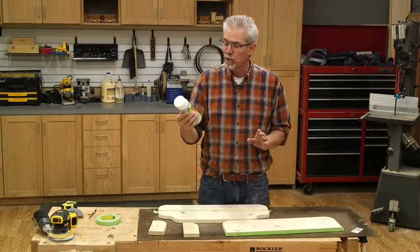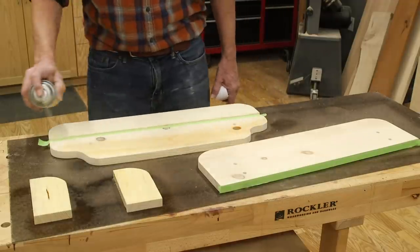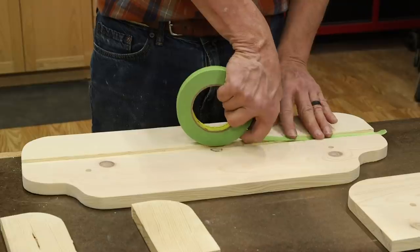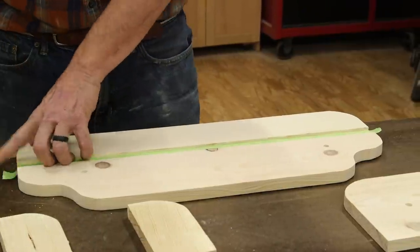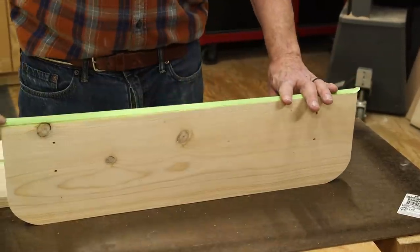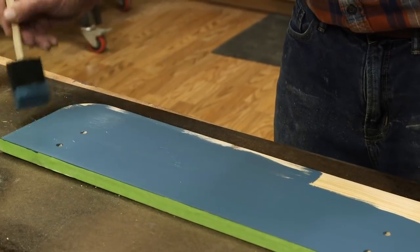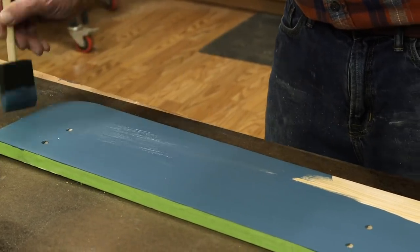Now take a few minutes to apply a few coats of spray shellac. This will serve as an actual clear finish for the back and the shelf supports. Keep the shellac out of the groove and off the back of the shelf where you'll be gluing it together later — I use masking tape for that. It'll also serve as a seal coat, or a primer coat, for the painted shelf.